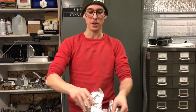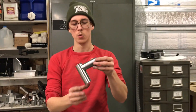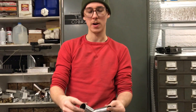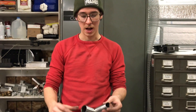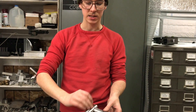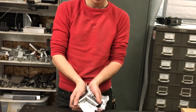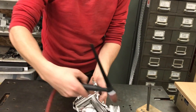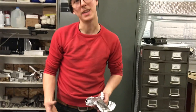If you use this stuff, you can fold it, cup it, and wrap it around. For instance, here's a really easy practice joint I'm doing — not hard to get gas coverage all around. But let's say there was a lot of wind or I needed to extend my tungsten a whole lot. I could just take the tin foil and kind of smoosh it around, and now when I'm welding right up in here, I've got all this foil to keep that area more protected. It's like a baked potato for your weld.